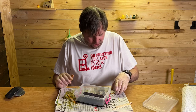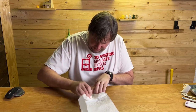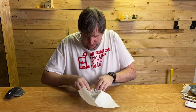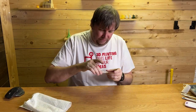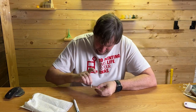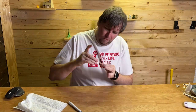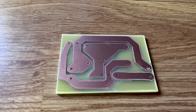Right, looks like we're done. Let me go wash this off under water — water neutralizes this acid, which will stop the etching process. We have washed it off and we're just going to dab it clean and inspect our results. And there we go — one etched PC board! There are some little pieces left under the holes, but we have a PC board that has been etched. Now let's take off the vinyl and see what our result looks like. Wow guys — a complete PC board, made at home on our machine using vinyl. It works!